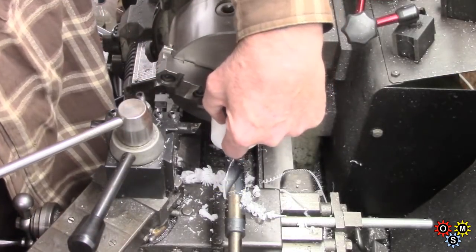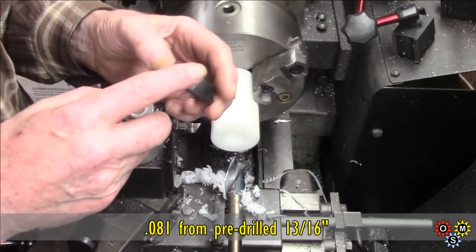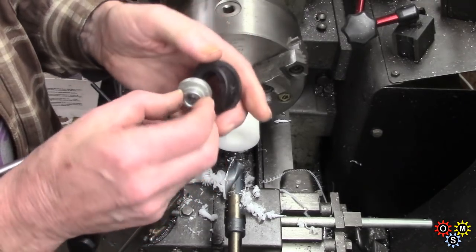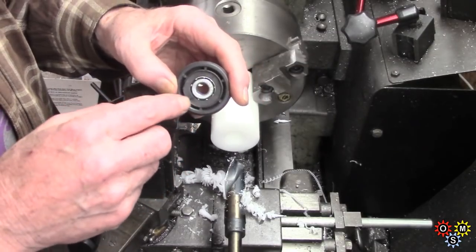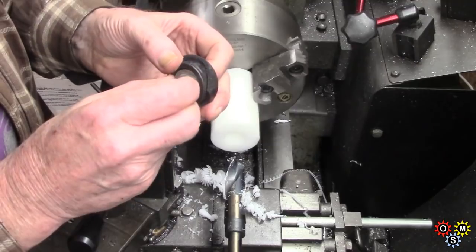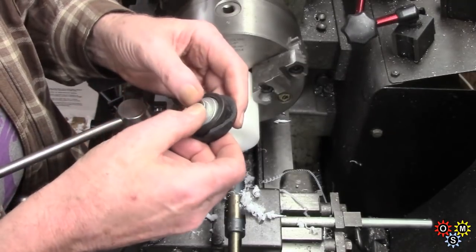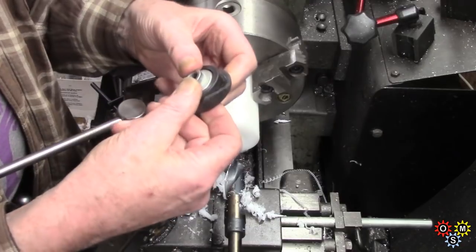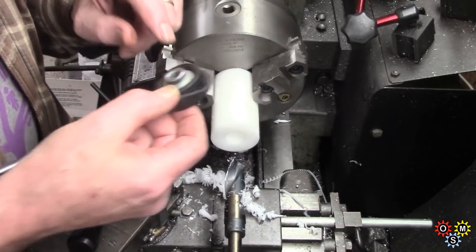Right, the first ID there is to approximate this, which is on the rear of the old insert, and then the bearing, which is a very basic bearing, that fits in the pocket, comes out the back a little. I'm not going to relieve that. It can just have a plain back, and the bearing, this is actually slightly rubbery, but the bearing is not a tight fit inside this pocket because the spring on the shaft has to be able to move it. So we're going to now do, on the first piece, a pocket for the bearing.